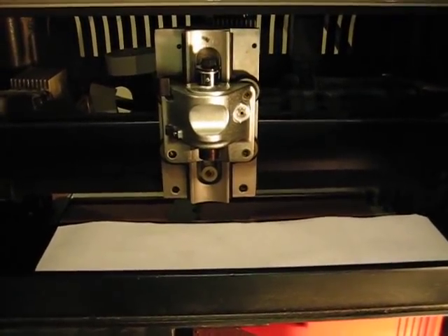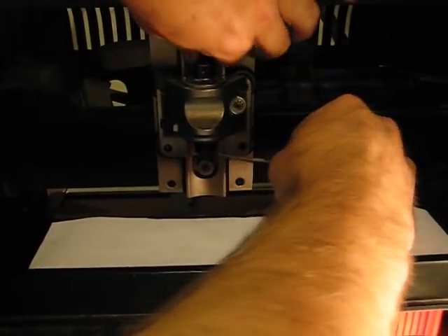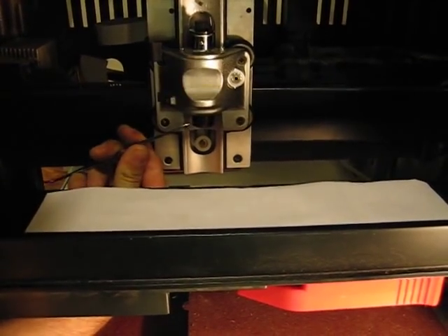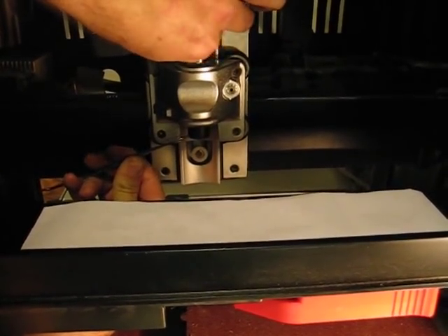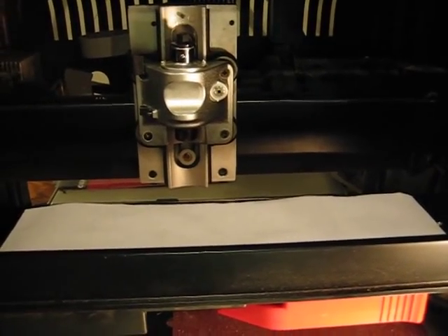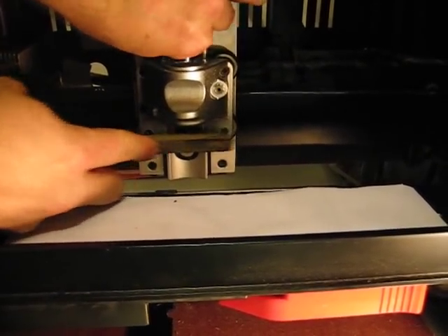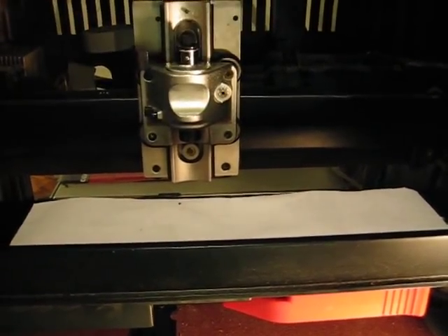At this point you'll want to take a pick of some sort — like a drywall screw or anything like that will also work. What we want to do is actually scrape the threads clean of any Loctite. Those threads were pretty clean, so not a big deal. I also have a little wire brush to clean those threads out nice and thoroughly. Once they're clean, you're good to go.